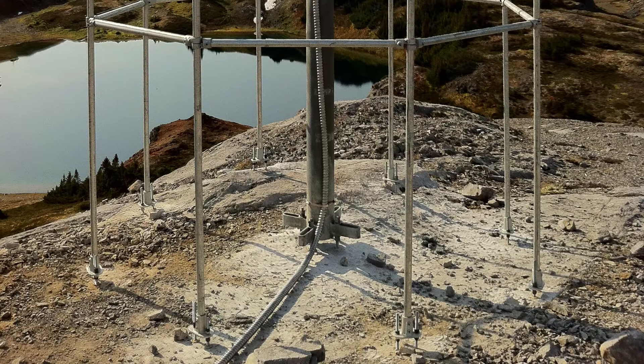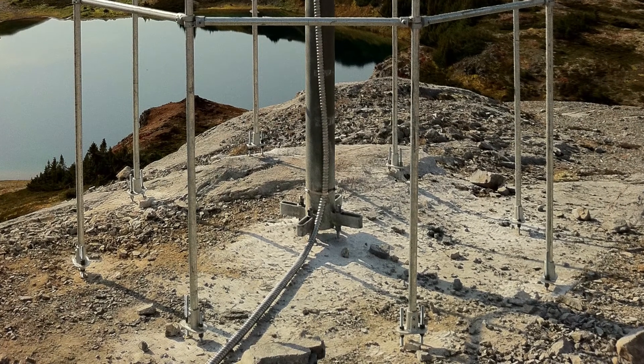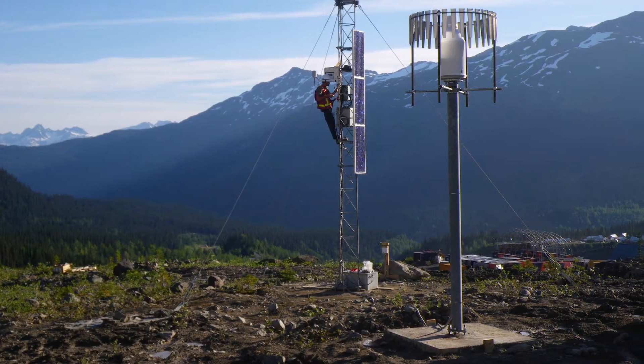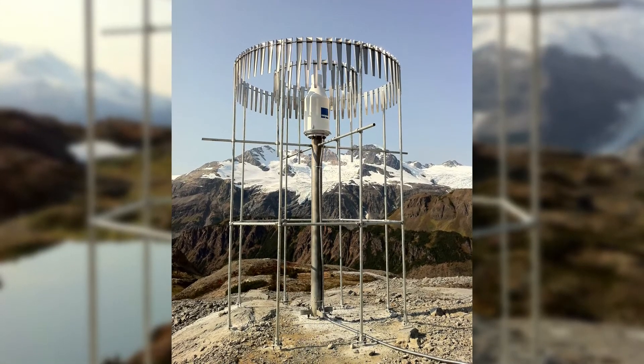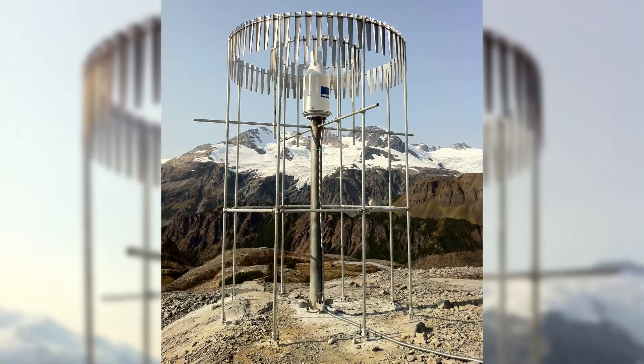I'm going to go through the steps one by one to get a proper mounting of the precipitation gauge and make sure you get accurate data. The mounting of the precipitation gauge is very important — without a solid foundation you can get noise induced into the data. A typical foundation will be made of cement, or bolts mounted in rock with epoxy. You'll use bolts, washers, anchor washers, and reaction bolts to hold the pedestal firmly in place.